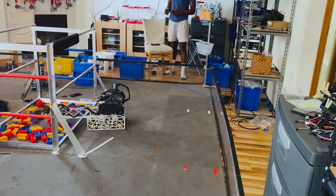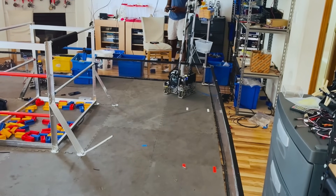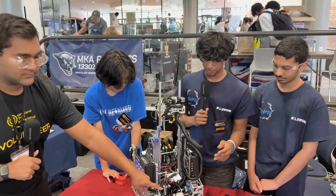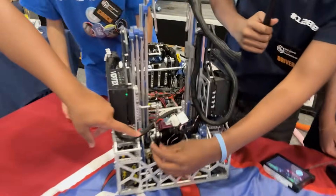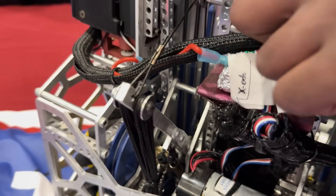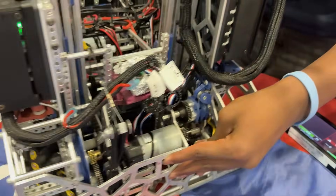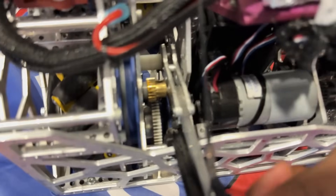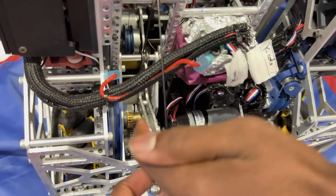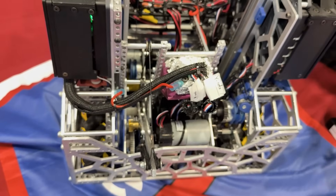Jumping into your lift and outtake — the slides are super fast. What are the key factors? The key factor definitely has to be our counter spring — we're running dual counter springs, two separate methods. The biggest part is inspired by Robo King center stage, where we pull this arm down with bungee cords. Before this we used rubber bands, but bungee cords snap a lot less and pull the steel cable. We rig our slides continuously rather than in cascade, and we do this with a dual spool system. The arm pulls on the steel cable, which rotates a tiny spool at the bottom, and with a large gear ratio this spins the flywheel super quickly — lesser torque but it spreads the force of the arm throughout the entire lift.